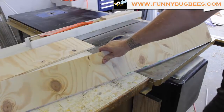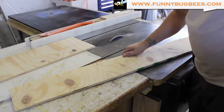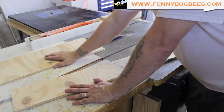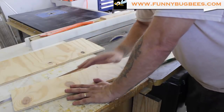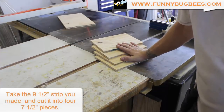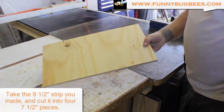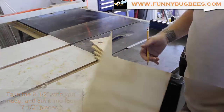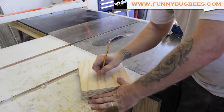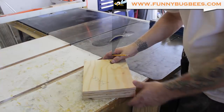What we're left with for scrap is about a six-inch piece of plywood. We've got blanks cut for our backs, fronts, sides, tops, and bottoms out of those cuts. We have four seven-and-a-half by nine-and-a-half inch pieces out of that last nine-and-a-half inch wide strip — go ahead and mark those pieces as backs and set them to the side.